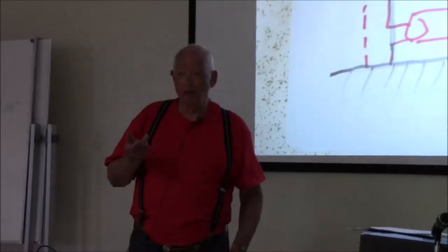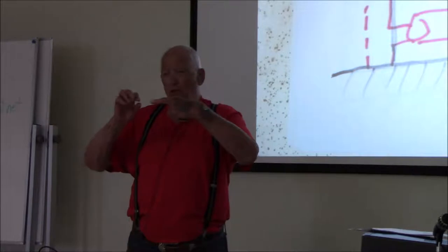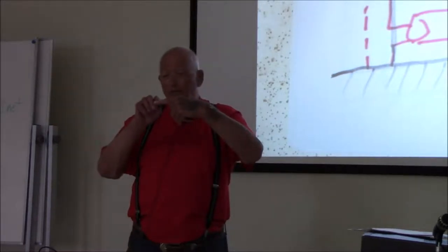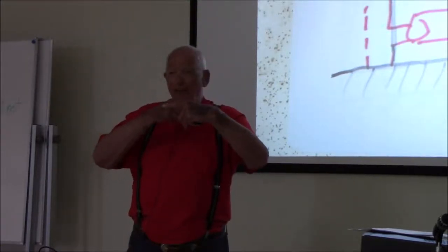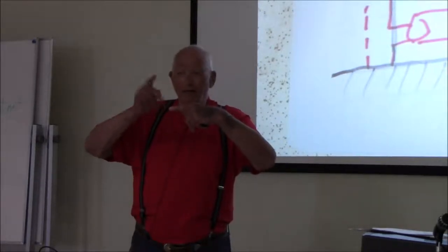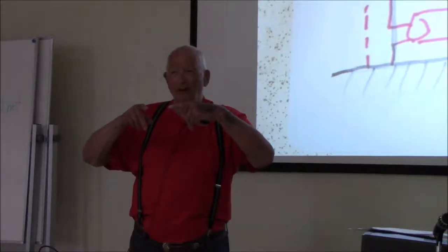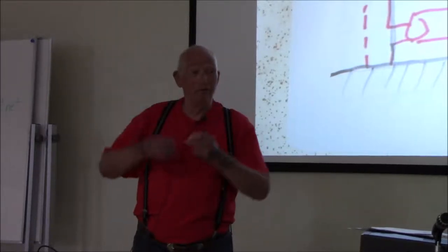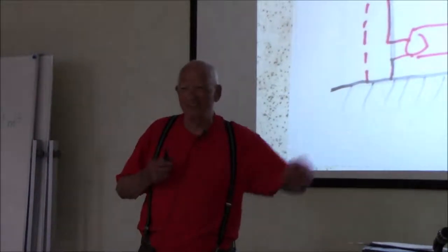And he built a thing called a coherer, which was two silver terminals in a glass tube with silver particles between them. When you put a radio signal across it, they all coalesce together, close the circuit, and would ring a bell. Now we had the bell clapper clap the glass and break up the filings. And then if the radio was still there, it would close the circuit again. And they made a receiver doing that. And they could receive Morse code that was sent on this transmitter.